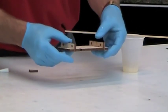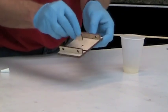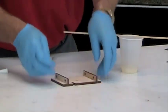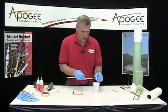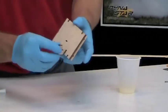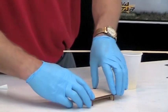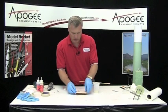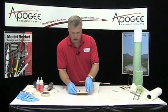That one gets glued there, and this one gets glued on the other side, because if you glue it this way it's going to block all thread from going through. So that gets glued there, and just make sure that nothing is going to run down and get on your table, or that will clog those holes — otherwise you've got to drill them back out.